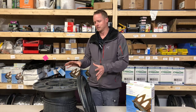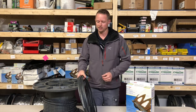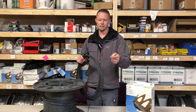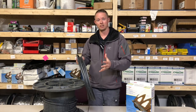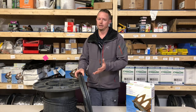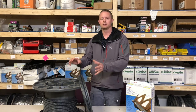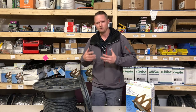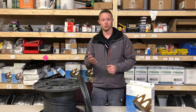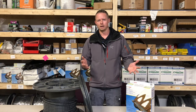When it comes to the downsides of self-regulating cable, it is more money — but you get what you pay for. A little more money gets you a much better product. Also remember that skilled technician requirement: if you don't terminate the ends correctly and put the system together properly, water can leak into the system, travel down the lines, and compromise the entire wire. At that point the whole thing needs to be thrown away, so make sure a skilled technician installs this for you. Additionally, most homes are not typically set up electrically to accommodate self-regulating cable — it needs more electrical availability to power up and operate properly. You may have to add another circuit, convert something, or make electrical modifications to your home.